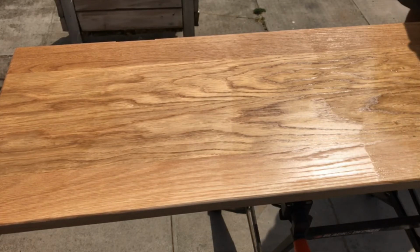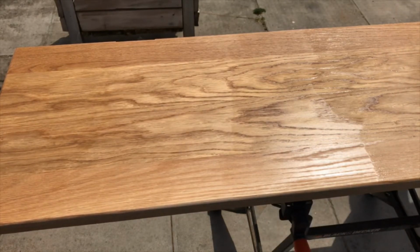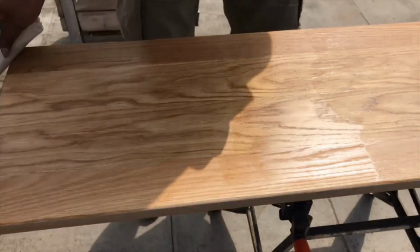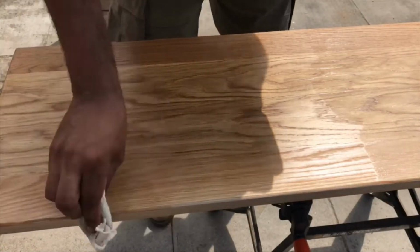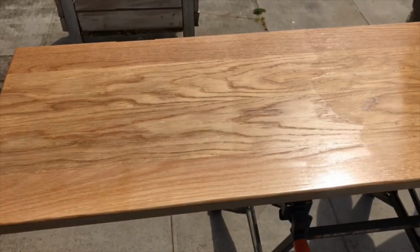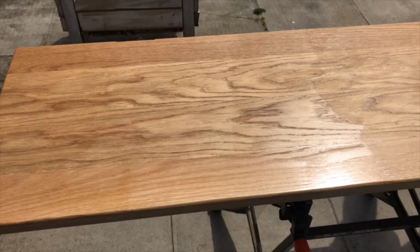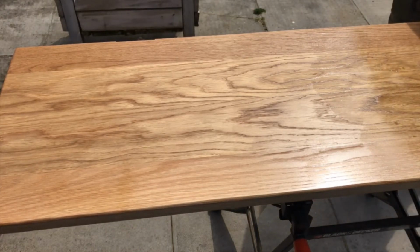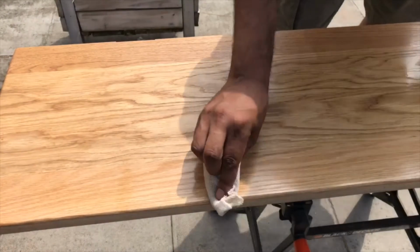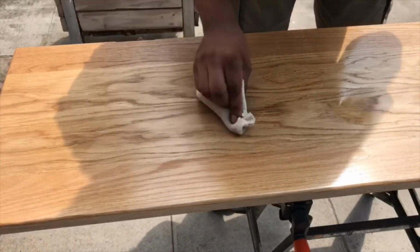Another thing I've done, guys, I don't know if the camera's showing, but when I was sanding, I smoothed it over. You know, it's going to be sat on, and if it was sharp, it might hurt the back of your knees. So it's nice and rounded. Not with a router bit, I did that with just a random orbital sander. It wants to have a bit of a rough look, nothing too fine of a profile.